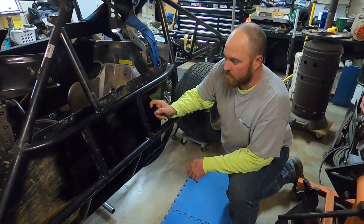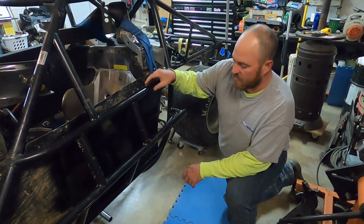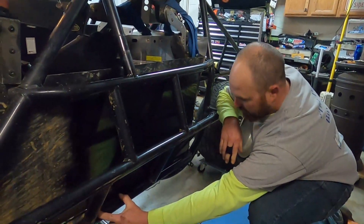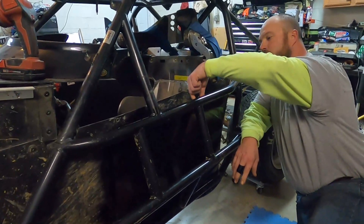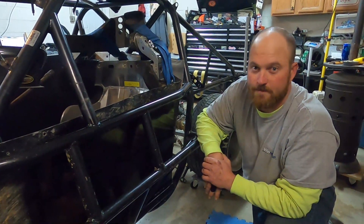We have completed our intrusion plate. Sam painted it after we got done welding, and this is what we've come up with — eighth inch, 26 by 16 inches, and it turned out pretty good. We only had one minor mishap where it kind of fell on us, but we got it situated back in and put a nice five-inch weld here, another five-inch weld here, and about two or three three-inch spot welds up in this area. Stay tuned for the next video — I should be putting in the rear end.